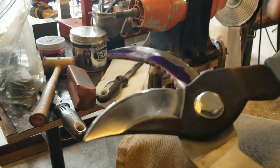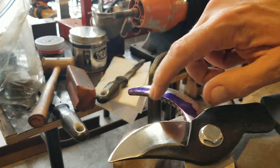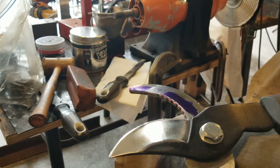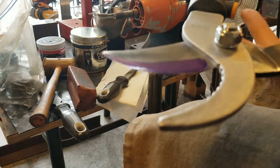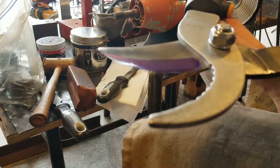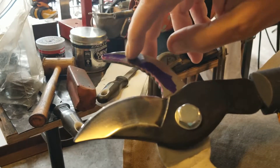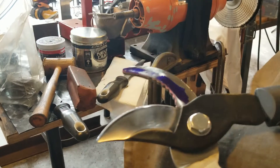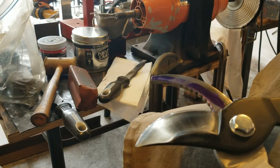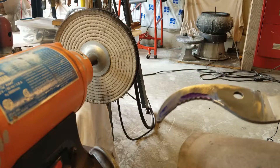After some filing on that spot, I can still see we're just a little bit high and low right there, but I'm getting a good consistent drag mark across the cutting surface. I'm going to take these apart and put this section on the buffing wheel. This is the real important part — see how we're getting a pretty consistent drag mark to make sure there's good full contact all the way across the edge of the plate. I'll buff out the file marks, and after a bit more filing and sandpapering on that high spot, I'll give it a polish on the buffing wheel.